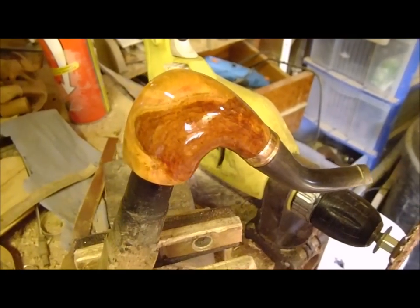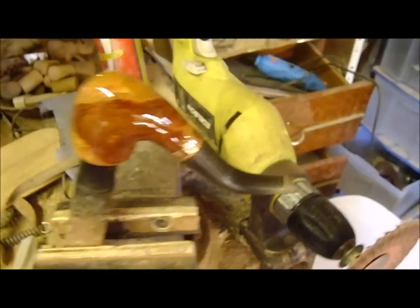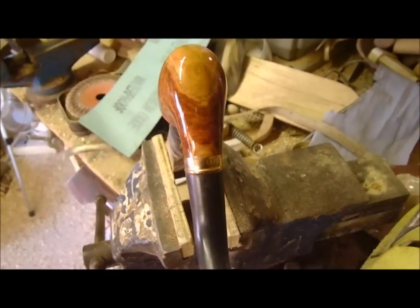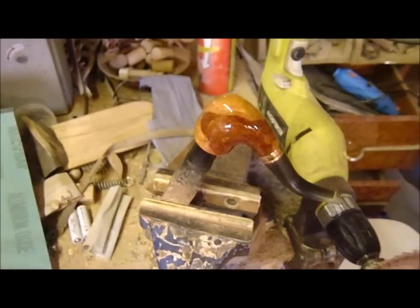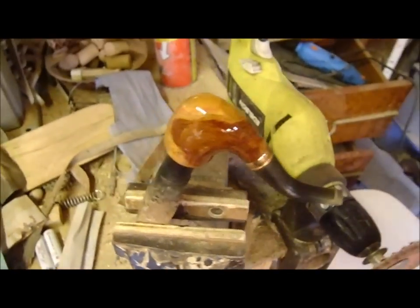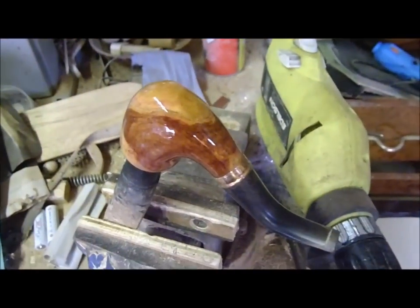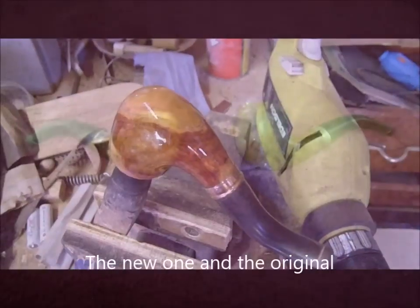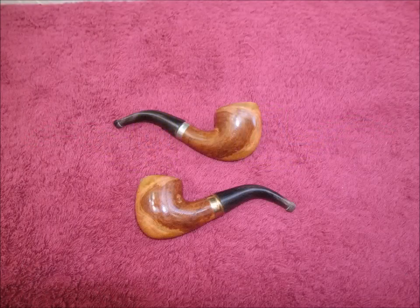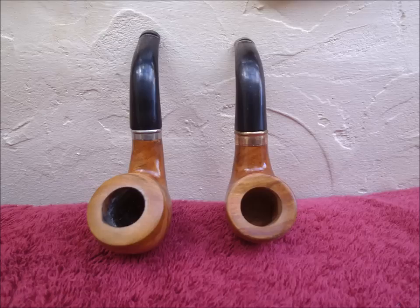There it is — that's the last coat of lacquer gone on. I'm literally just waiting for it to dry. It's a fairly heat-proof lacquer so it works rather well for this. Once the lacquer's dried I'll give it all a buff up. It's two very thin coats of beeswax and a coat of lacquer, then I'll knock that back with 1000 wet-and-dry, and a second coat — and that's it drying now. I'll take some photos at the end.